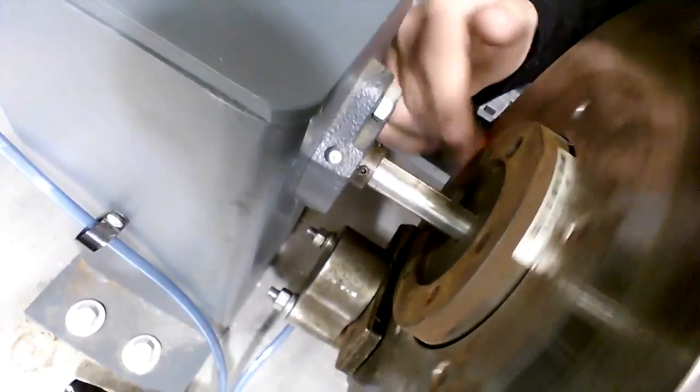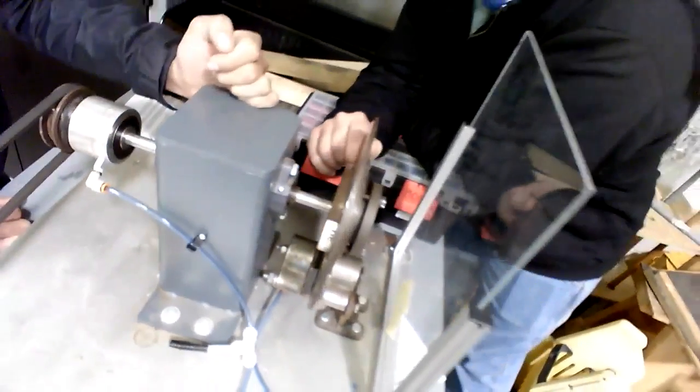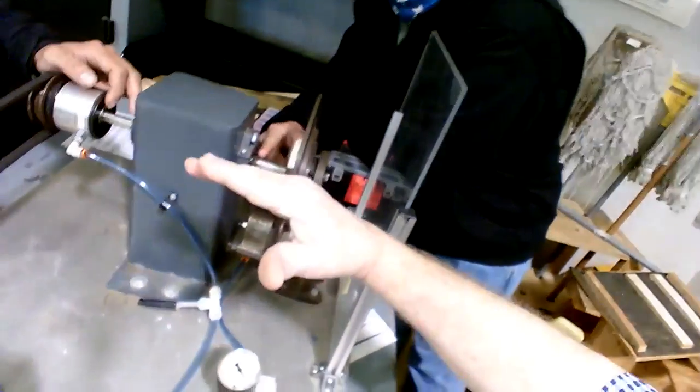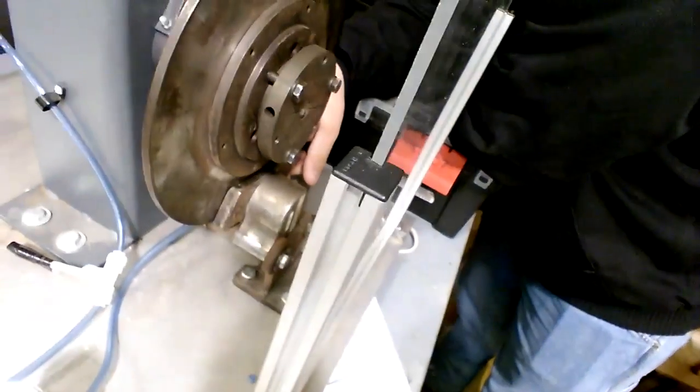I'm gonna put it up here. Tell them again. He loosened the set screws and also on that side. Show them there, set screw on that side. So if I back up a little bit, point at both of them at the same time. You got the set screws that they loosened up, and they were able to actually move the shaft over that way and fine tune that rascal. And that's a whole lot faster setting that gap there than breaking loose that QD bush in there.